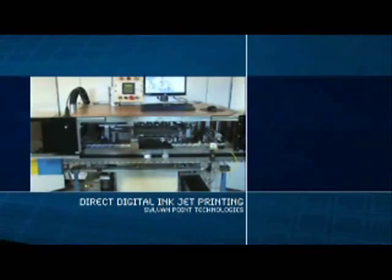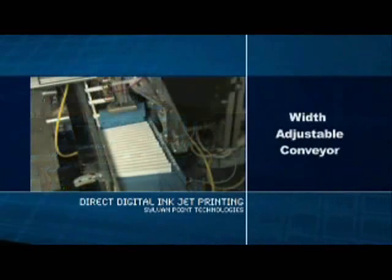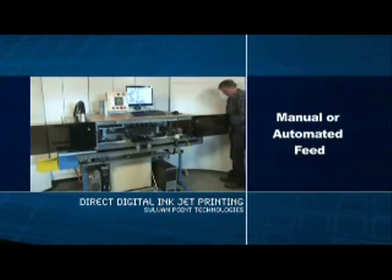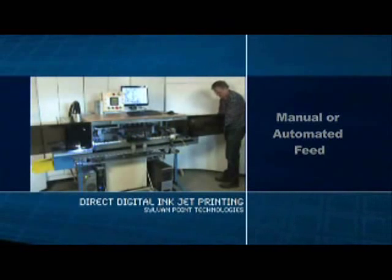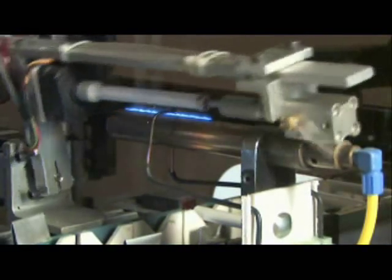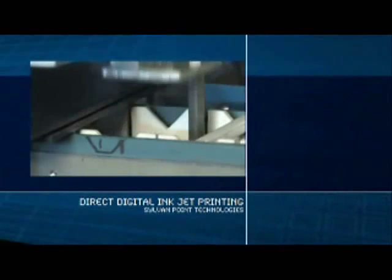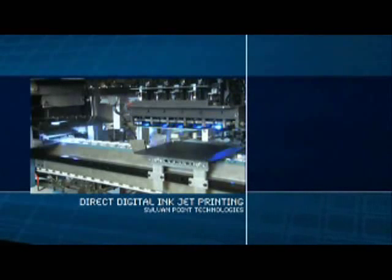Now a description of the Sylvan 500 DIJ printer. The conveyor is width adjustable to accommodate the longest and shortest pen. Pens can be fed manually or from a typical feeder, dispensing one pen at a time onto the conveyor, which has variable speed control. Pens then travel and rotate under a flame treater, where the width of treatment is adjustable. Pens are lifted pneumatically one at a time from the conveyor and placed into a mandrel, which carries the pen through the printing process.